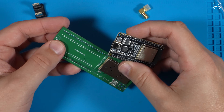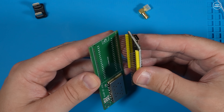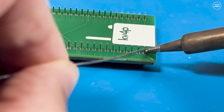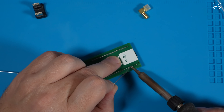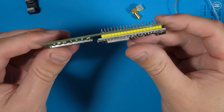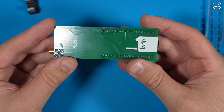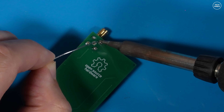Now we need to fit and solder the ESP32 development module. There are quite a lot of pins, but just make sure the USB connector on the ESP32 board is located at the bottom edge of the PCB like this. Again I solder one pin first just to make sure the ESP32 module is totally flat against the PCB, and then I solder the rest of the pins. Once finished you will need to trim each of the pins sticking out of the board, as this is the side which will rest against your phone or tablet. Just be careful as they are pretty tough and they ping everywhere. Personally I cut mine while holding them just inside a rubbish bag — or trash bag for you American guys.